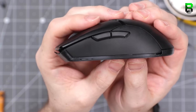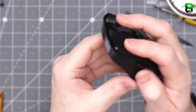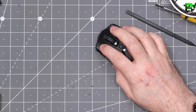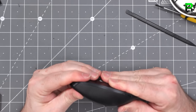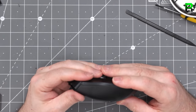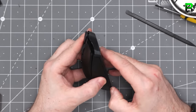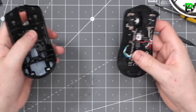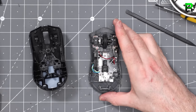It's going to take you a while to get this to fit right — you have to keep trimming more and more plastic. You can always take some out; you can't put it back in. Check your buttons front and left as well, and make sure the switch is connecting right. You might need to add additional tape to the plunger or pad out the base a little bit with some tape to get the switch to the right height. You'll only know that once you try and fit the shell, and it depends on each mouse how much you need — you just have to feel where it sits.